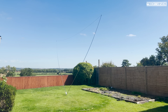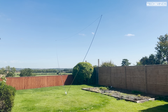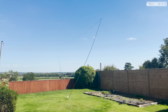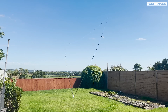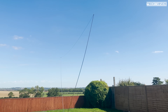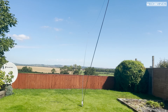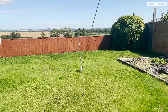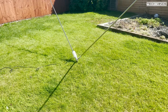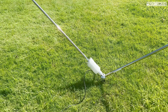After extending both telescopic elements as far as they will go, we still need to connect the 50 ohm feeder cable to the SO239 socket on the bottom of the matching transformer. As you can see, I have this delta loop mounted on the ground pointing north-south. As delta loops are most affected broadside, my signal will work better east to west. Of course you could easily swing this antenna around or even mount it on a mast above the roofline with a rotator, though remember this is a portable antenna so not really suitable for permanent installation.